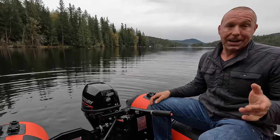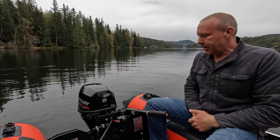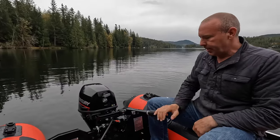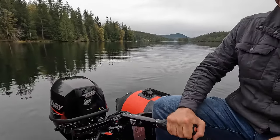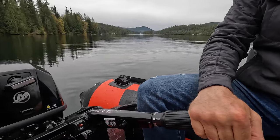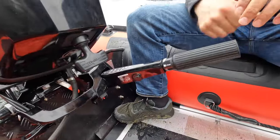It's kind of nice to see it in person. I did go and watch a video on this yesterday, so I'm relaying that information today. The trick with this outboard is: when you want to tilt it back, make sure the motor's off, tilt it to forward, and then you can push down on the tiller handle and you're good to go.